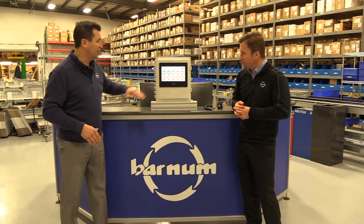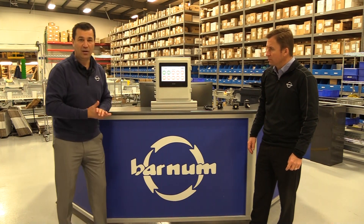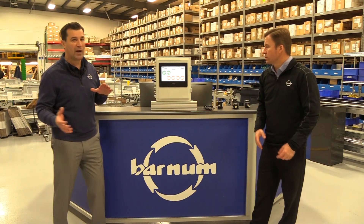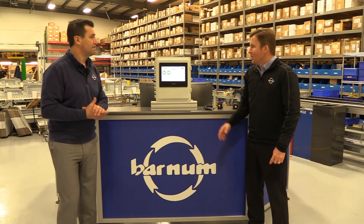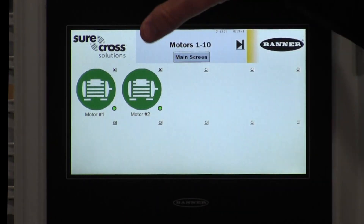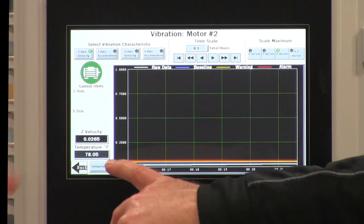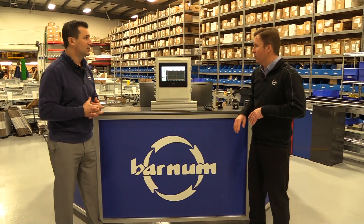On the screen, we have two motors that are both functioning and running well — their color is green. The ones that are orange have nothing set up for them yet. You can eliminate those so they're not noise to any operator. At this point, you are essentially done with your condition monitoring setup and it just took a matter of minutes. If you dive deeper into a specific motor — say motor number two — you can see temperature, vibration relative to baseline, and the color status. Green means the motor is running within what we taught it as our asset baseline.